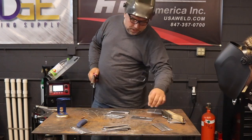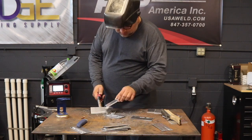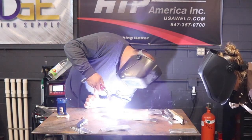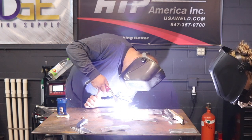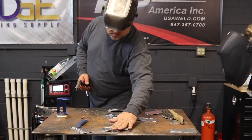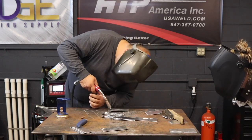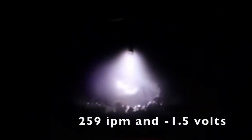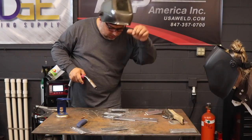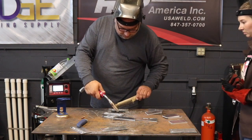The negative 2 setting is a little bit optimistic — I should probably be at around negative 1.5 or so. At 2.59, that's it right there: right arc length, right penetration. No soot, no BBs, and when you look at it, very mild push-through.